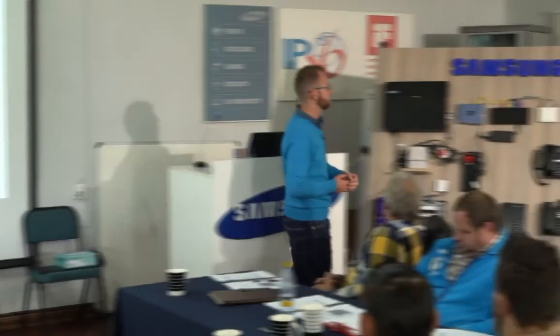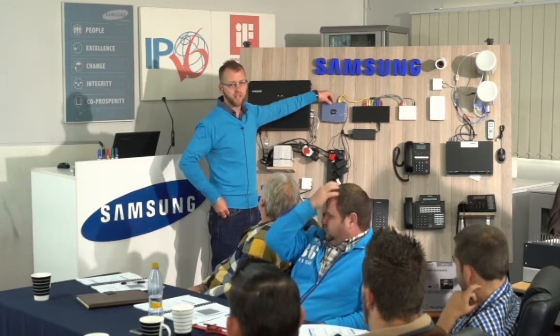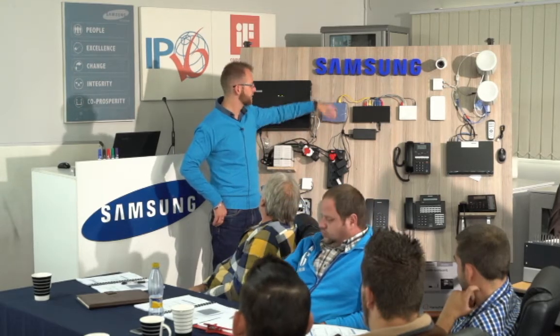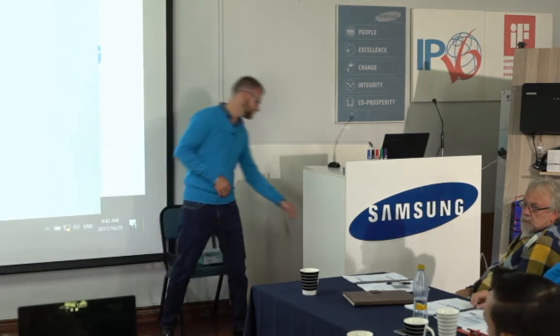So on a Billion router, you have FXS extensions. On the AudioCodes, you have FXS. So on this device, it's got two ports here, which will be pre-configured. So you can plug an analog phone directly in here, and you'll be able to make a phone call. Could you not, sorry? Yes. Could you not use the FXS port into like a 7030 as well?